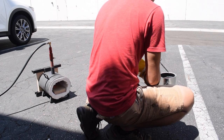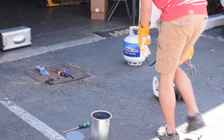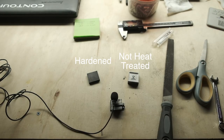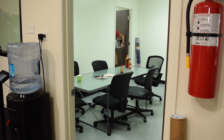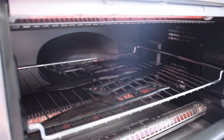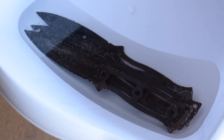On a knife this small, the risk and consequences are really quite minimal, but plenty of aspiring swordsmiths have been figuratively burned at this phase. Once you can safely wipe off your blades, make sure they're actually hard. The term for this is 'skating a file' — it basically means the teeth of the file don't bite into the workpiece. The file will still remove scale and eventually abrade the piece, but it really won't dig into the steel. After confirming I hadn't screwed up my heat treatment, I immediately put the blades in an oven set to 400 degrees Fahrenheit for tempering. Fresh out of the quench, these knives are extremely hard but also brittle. Tempering slightly reduces the outright hardness but makes the steel much more impact resistant. I ended up doing two tempering cycles of two hours each. Between cycles I cleaned the blades — I tried a soak in vinegar to help loosen the scale, and it seemed to work, but being no expert, there might be more effective ways of doing this.